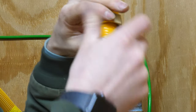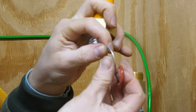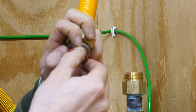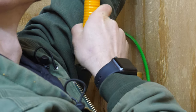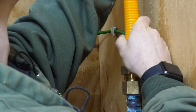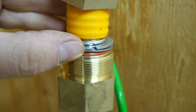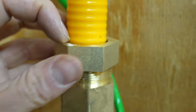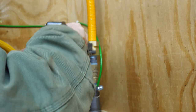Got my tube stripped and as always I've got my instructions in hand — never too proud to read the instructions. It's saved me from a lot of stupid mistakes. First step: nut. Second step: split ring. Then solid ring on. Slide that up and roll the little red o-ring on without cutting yourself. I gave myself some wiggle room up top to push up then pull down. Got the split ring, the solid ring, then the o-ring right up against the end of the fitting. Quarter to half turn — I'll give it about three-eighths of a turn.